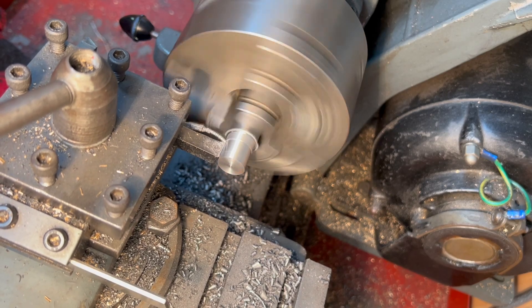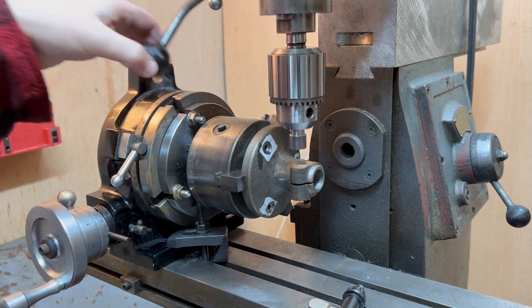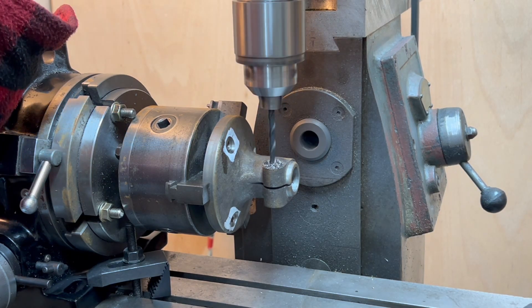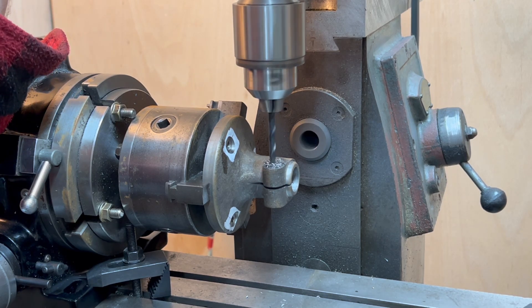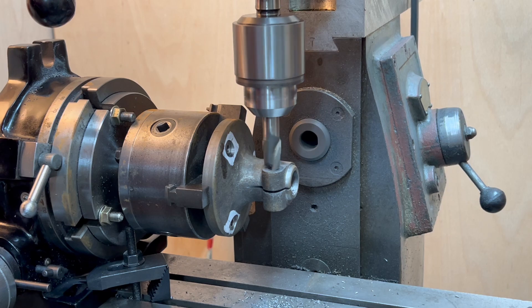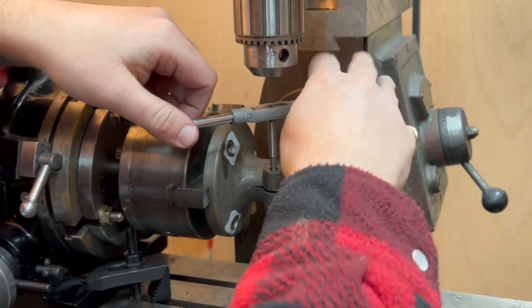Now I want to make sure that the location is correct for drilling and boring. I did this plug here for the same diameter as that round section and arranged it like so. And again now we're going to spot drill and we're going to drill all the way through with number four. I'm going to drill an F to clearance at the top, a bit of a spot face just to make sure there's a flat surface to clamp onto, and then I'm going to tap quarter inch BSF, which is what all the fixings are in this kit.